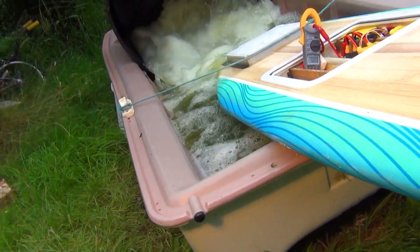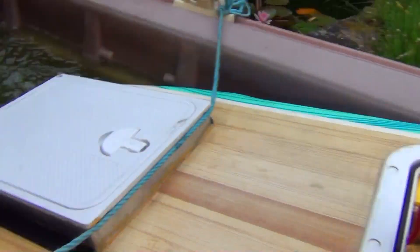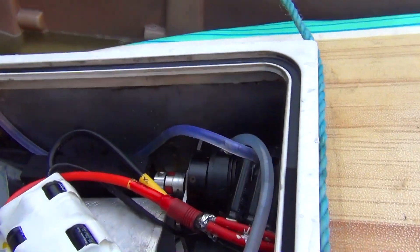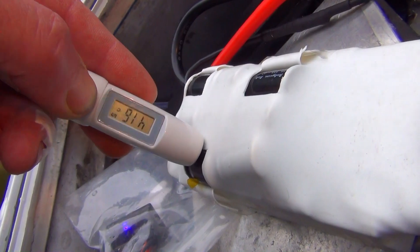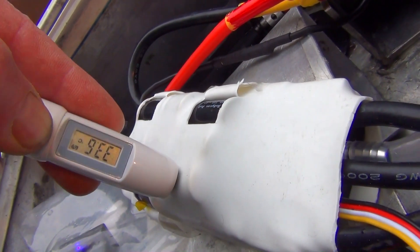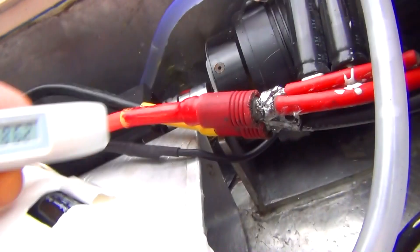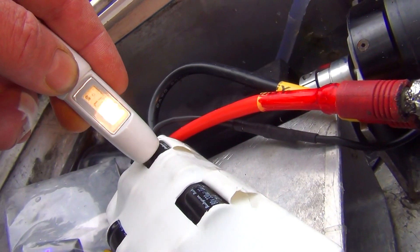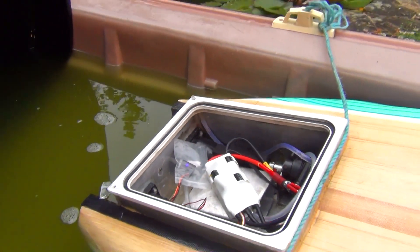Just a quick look at it for any heat. I'm going to wind it and then get a little bit harder with it. Readings: 34, 41, 37, 33 — they're up to temperature now, they're over ambient. The motor is 27, 28. My caps are 31 — oh yeah, they're working nicely as well. They're well balanced too. It's the first time I've tried it with the caps on.